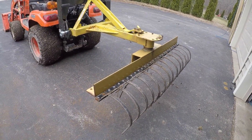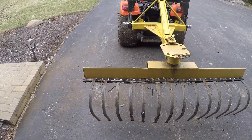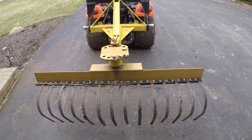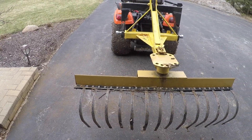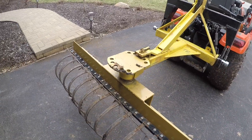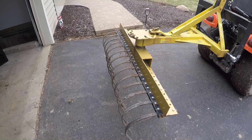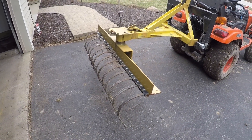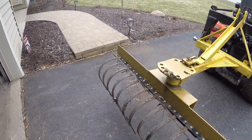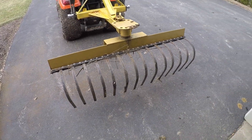There you can see how I've cut it off. I just made it equal, but then once I took out some of the teeth that's just how it worked out with one extra spot on this end — I can always add more in. Otherwise everything's getting clogged up in it all the time. If you don't have enough space between the teeth you're basically just plowing the dirt instead of combing through it and pulling out the rocks and the sticks and the roots.